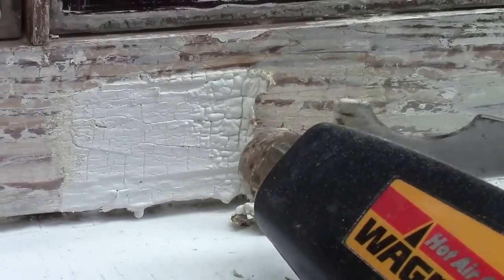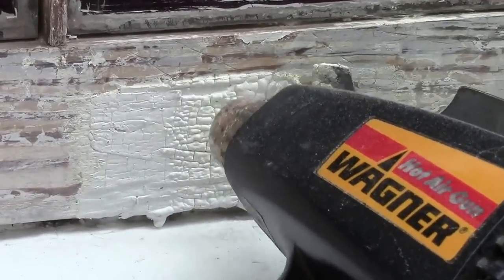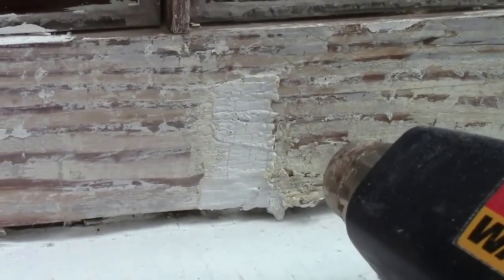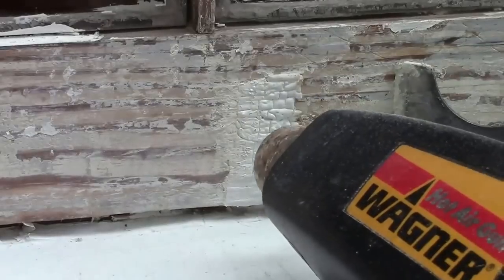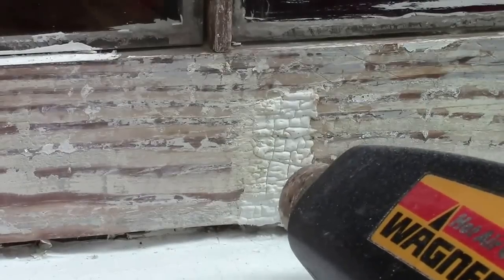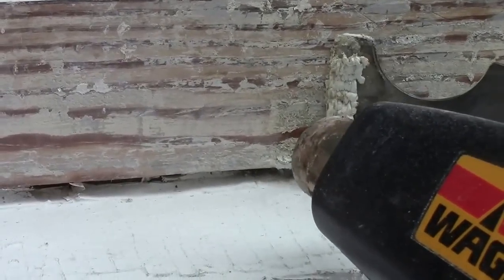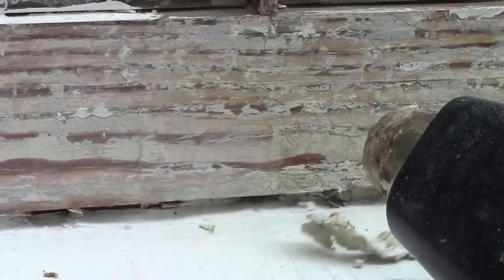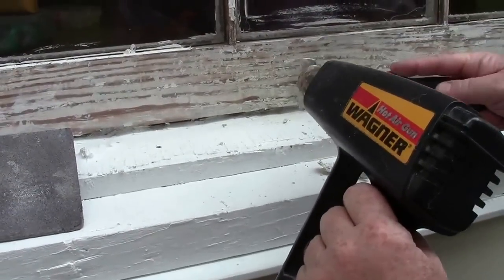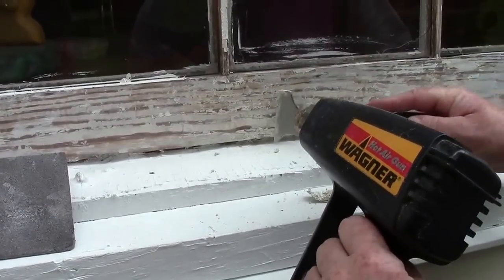I don't want to get any of the wood. It's a slow process, and I've chosen a day that is not very hot — fortunately it's in the low 80s today, because this heat gun does get hot. It's a pretty straightforward process, it just takes quite a bit of time. With so many coats of paint you still have hairline cracks where the paint has cracked over the years and it just does not look good.